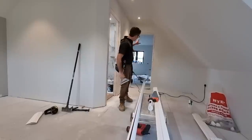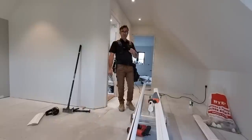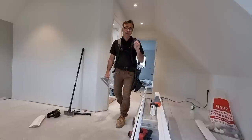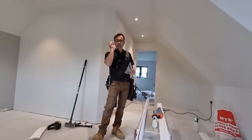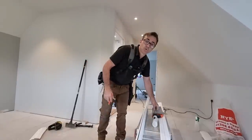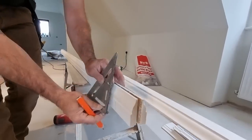This example works really well, for example, where you've got a finished floor like that, because you want your architraves to be hard against the finished floor, a nice crisp cut, and that's the one you might want to afford to do on your chop saw because you know it's going to be nice and crisp. You haven't got to really mark it too much with a saw, for example. So we'll cut these in. Just cut them off.